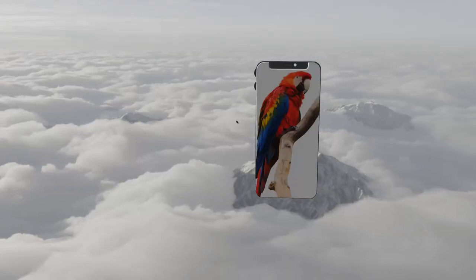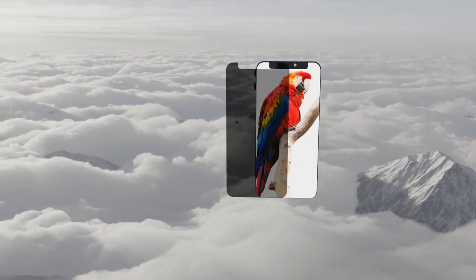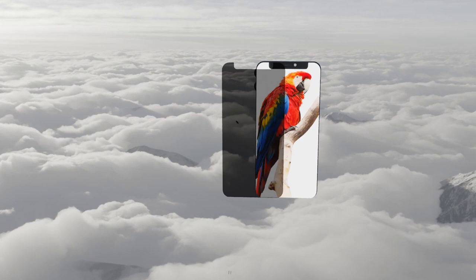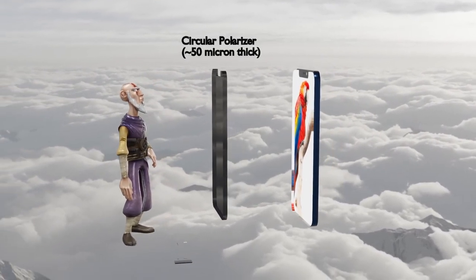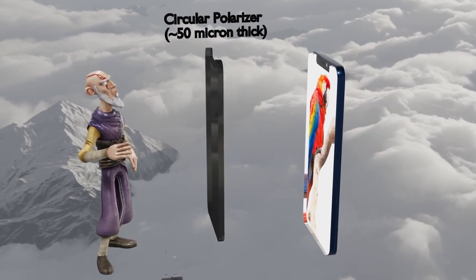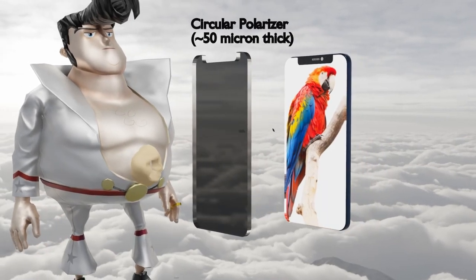But there is also a dark side. Half of the OLED light generated inside is absorbed by this film. Instead of blocking the reflection of extraneous light, you lose half of the efficiency. There is another problem. Circular polarizer film is in the form of stacking four or more films with various properties, and the thickness reaches 50 to 100 microns. It is rather thicker than the OLED itself, formed on a plastic substrate. The navel is larger than the tummy.